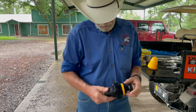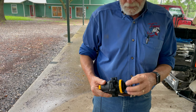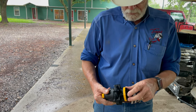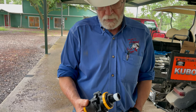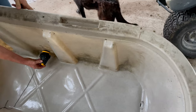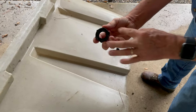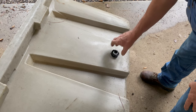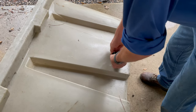The Mega Flow valve comes with the right parts. You unscrew the male end that fits through the hole. Leave the washer on the inside of the tank — it stays with the valve. Tip the tank over, work the fitting through the hole — it has an up and a down orientation. Put the flat side of the washer against the tank, screw it on, and tighten it hand tight plus a little bit. That should stop any water leakage.